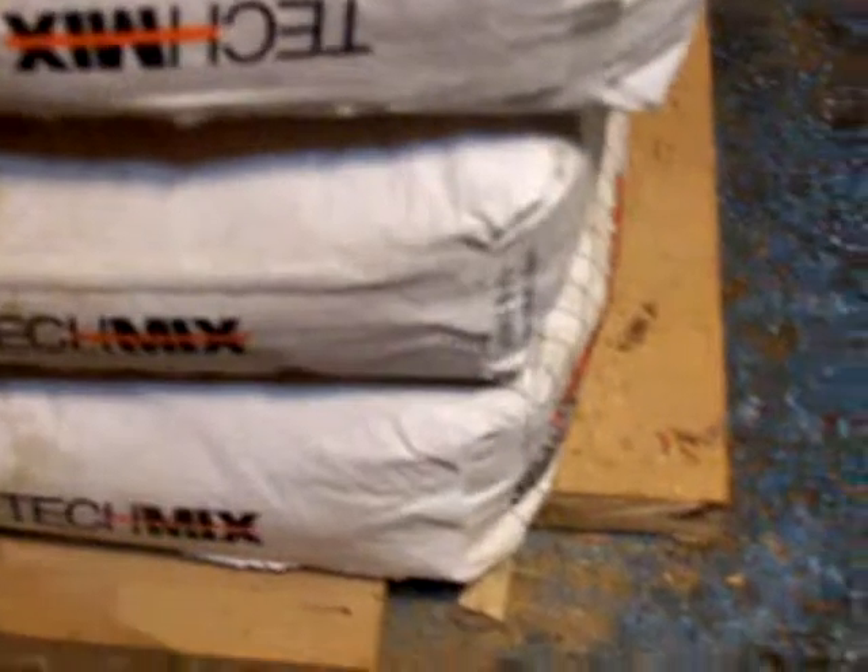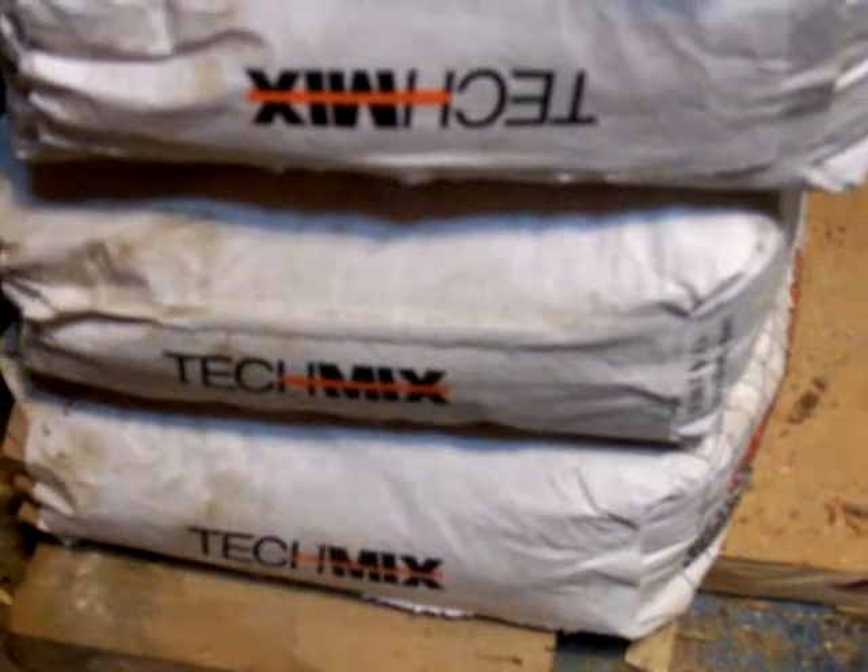Big pouch — 6 kilos, about 14 to 15 pounds. There's a recipe on the bag that says if you want to make concrete with this, there's a recipe: 6 parts — a full bag with half a bag of Portland cement with 20 liters of water. I'm going to be more like 3 parts to one — I want my cement to be strong. And I'm going to add to that cement these 3 bags here — those are sand and cement already mixed, you just need to add some water. And there's my Portland cement bag.